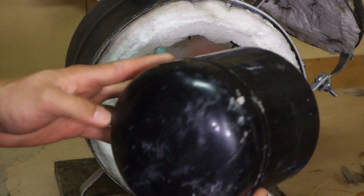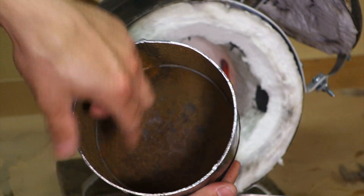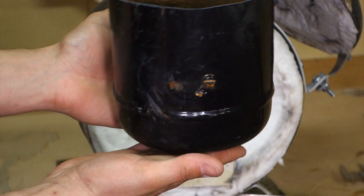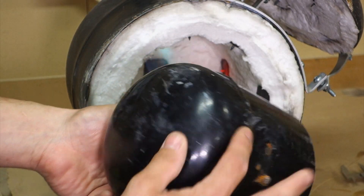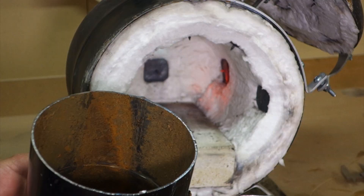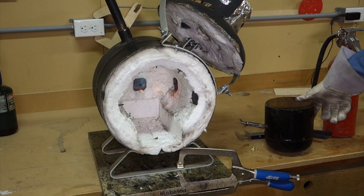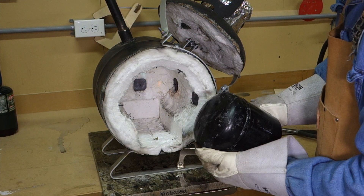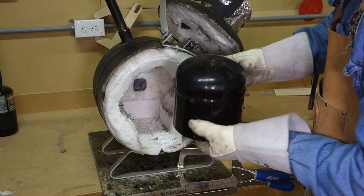I do intend today to modify my new crucible. This was an old one — I'm going to use the worn-out air tank off an air compressor; I cut off the piece that I needed. Because it has a bell bottom it doesn't make a very stable platform for melting metals, so my intention is to stick it in the furnace, heat it up red hot, and then get my blacksmith on and pound it into a concave shape so that it will sit flat. I'd cast out of this instead of those breakable silica dishes. When I went to put it in, it wouldn't fit — it hit the nails up top holding in the ceramic insulation fiber. So I've taken the brick out and set it around back; I don't really need it because I don't need a flat workspace to heat this up.